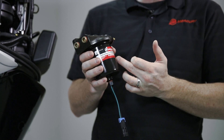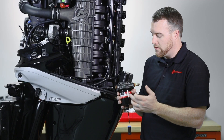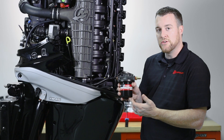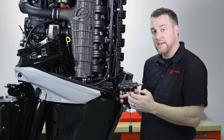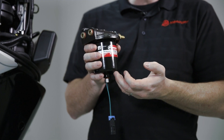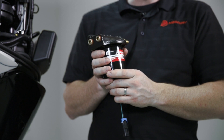The other part of your fuel filtration system is your water separating fuel filter. This filter is mounted on your boat in the vertical position, just like you see here. It takes the fuel from the tank, helps filter any kind of debris out of that fuel, and also lets water collect in the bottom of the filter. From there, the fuel flows into the engine's fuel system.